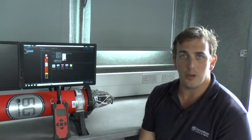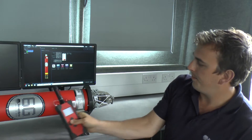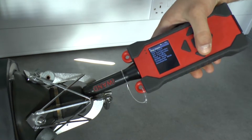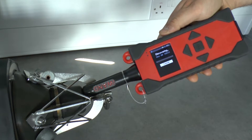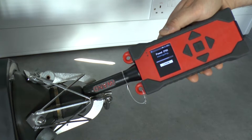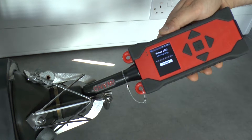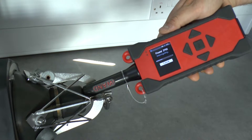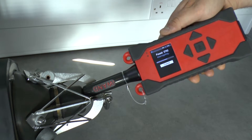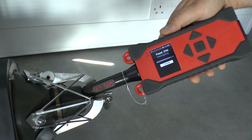We're ready to get started. We have an iWAND and a 6G transponder on the back deck of a vessel, and we need to upload the information from the transponder to the iWAND using the GET configuration. Scroll down to GET configuration and press ENTER twice. Remember to keep the iWAND antenna firmly placed against the transducer. The iWAND will then acoustically interrogate and discover the current settings of the transponder. In a minute the iWAND will ask to do a release test and also a sensor check — we're going to click no as we'll be testing these later.